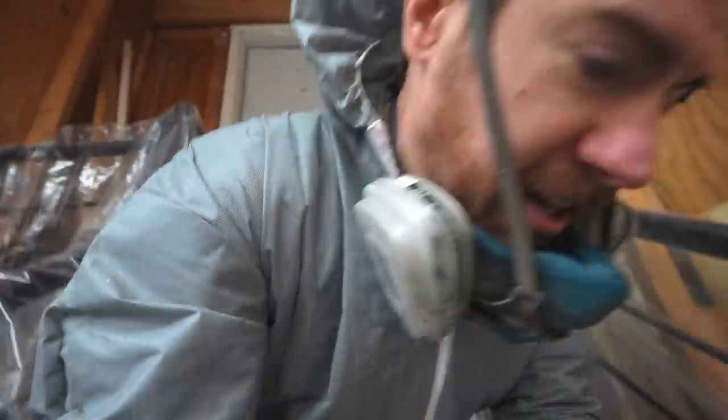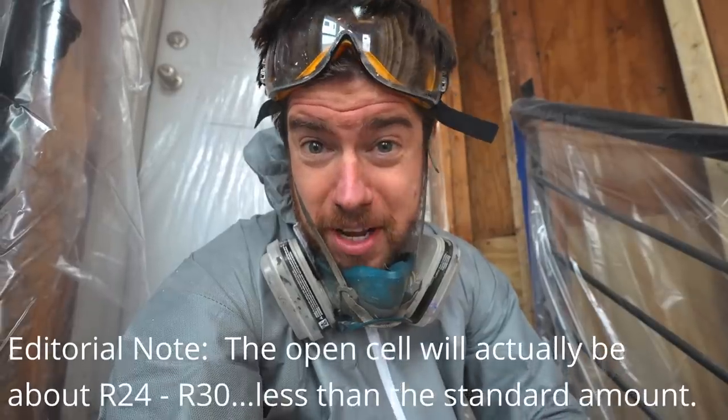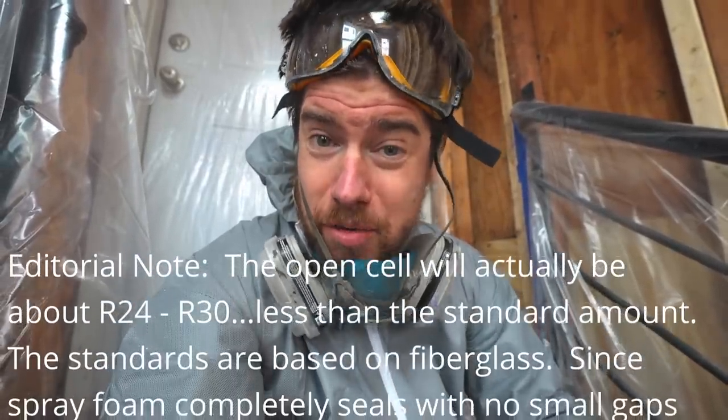I just wanted to sit down here, have a little chat, explain what you just seen. So there are zones and there are different ratings for how much insulation you need depending on where you live and which zone. Chicago is in zone 5, so I'll have to check the chart, but I believe it's between 38 and 49 is the R rating you want.